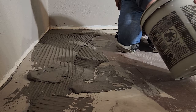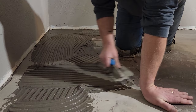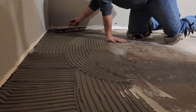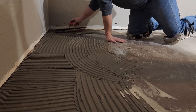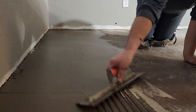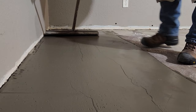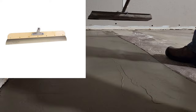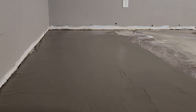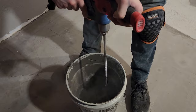There's that big stand-up trowel that I got — we're going to need that. And then we're also going to need that bucket with the water in it that I've been using to make the fill. Now I'm just taking a finishing trowel and I'm going to smooth it out. I'm not pressing down too much — I don't want to take any away. I'm just trying to smooth down the ridges. You can see we'll probably have to put one more coat after this. You can mix it to your desire — you don't have to follow the exact instructions on the bag. You can make it a little thinner with a little water and it's going to be just fine.